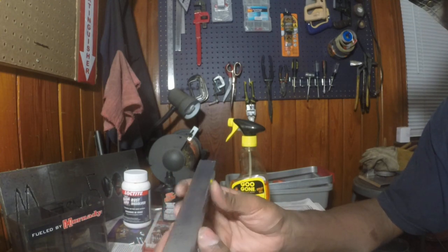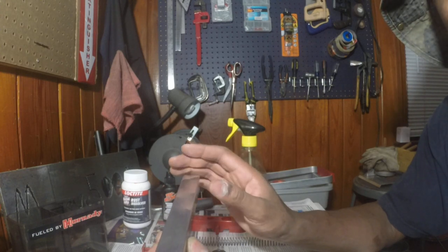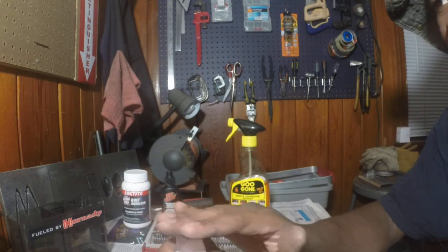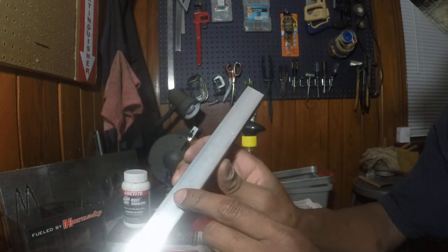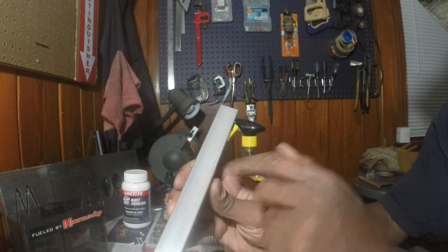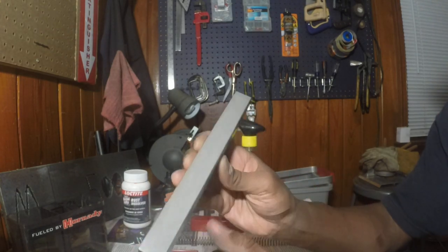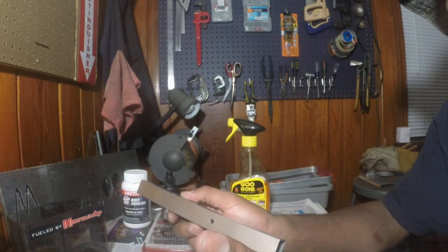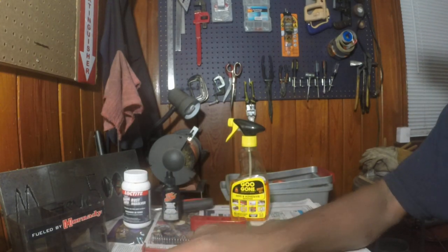And one thing I did was I took quadruple-zero steel wool and just rubbed this down to get rid of this sheen. You can see these marks. This is running up and down, and this is the side where I use the steel wool. Another side just has a lot of fingerprints on it, but it's smoothed out very well. And that's just to ensure that the reloader will operate with fewer hang-ups.